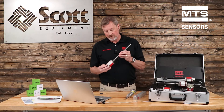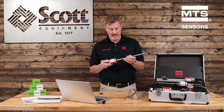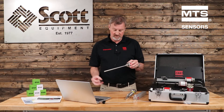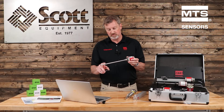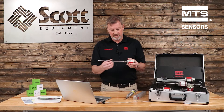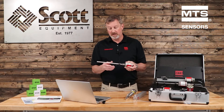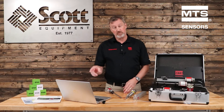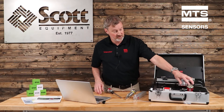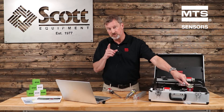One of the most common types of magnetostrictive sensors offered by MTS is like this. You take a simple sensor which has a waveguide along the tube, and you can take a north-facing magnet. As that magnet is moving up along the sensor, you get constant feedback. The additional things you can find are this — if we take a look at the web browser interface, which we access through the TempoLink Smart Assistant, we see a lot of useful information, which I'm going to show you next.